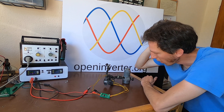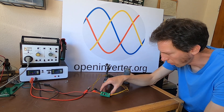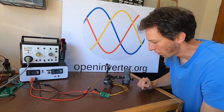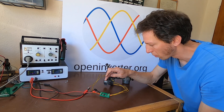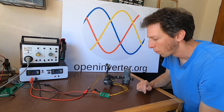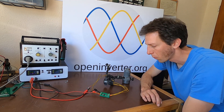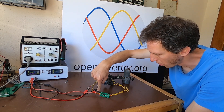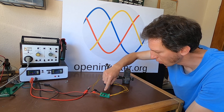And here we have our innovative product, which is just a threshold switch. It reads the output from our pressure sensor and controls the vacuum pump — basically switches on if the vacuum becomes too little. We have our 12 volts coming in here, red and black, and the pump negative that's switched by the MOSFET going out in the middle.